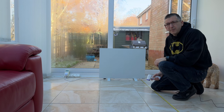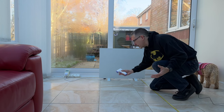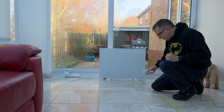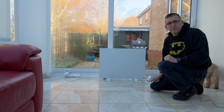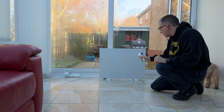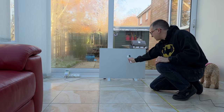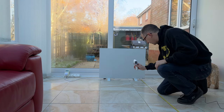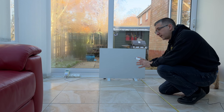I'm going to take you now to the coldest room in my house during winter — my conservatory. I thought I'd try and be a bit more scientific about how I demonstrate the effectiveness of this panel, because it's all very well me standing in front of it saying it's really nice and warm. So I've set up a tape measure along the floor and I've got an infrared thermometer here, and I'm going to take some temperature readings at different distances. At the moment, having let it get up to full temperature, it says 73 degrees — it takes about five minutes to get there. At half a meter away, that's 72 degrees.